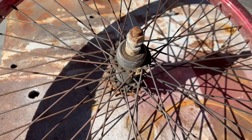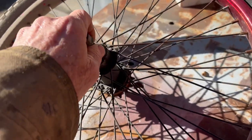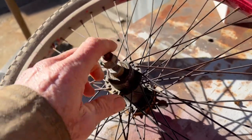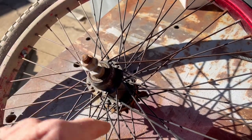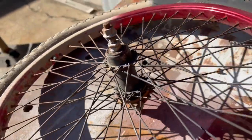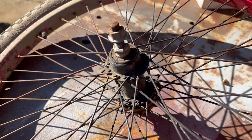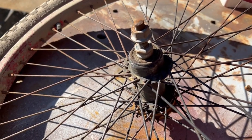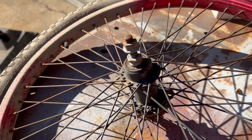Typical bicycle wheels are mounted on bearings so that the axle does not turn when the wheel spins. But a unicycle is the opposite. The axle has to be fixed to the wheel so the cranks can turn the wheel. So since this is a back wheel, or was a back wheel, I think the hub is big enough to slide some sort of solid axle through there. Something big enough I can put a bearing on each end and attach the cranks to.